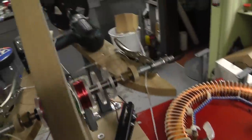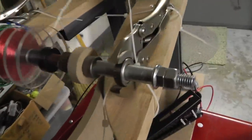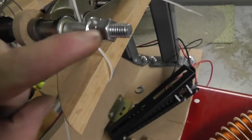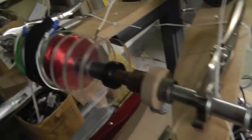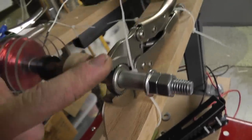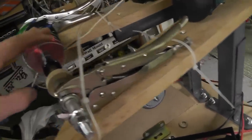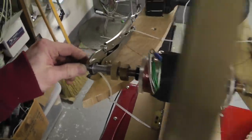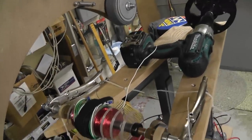I made this quick little thing — basically I've got a piece of 3/8ths. This looks like all-thread but it's not; it's only threaded on the very ends. I've got bearings that fit right on there, put those in these vise grips, and then zip-tied the vise grips to my stand. It was the only thing I really had available, so it's what I used. Now it spins freely on these two bearing sets and I'm just unwinding it with the drill.